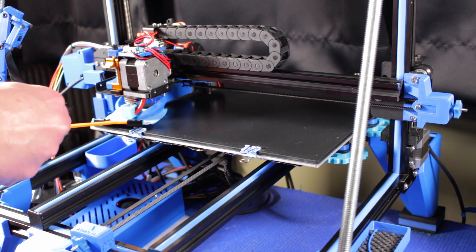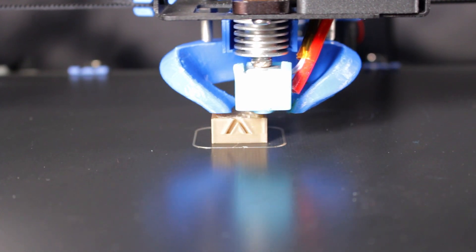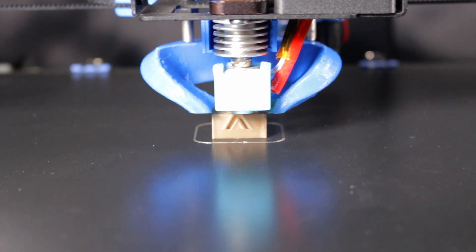Well, that takes care of the repair and the mods. All in all it really only took about an hour from start to finish — 27 hours if you factor in the filming and the editing. Once everything was put back together I did a manual bed leveling since I don't have auto bed leveling, then I ran a few test prints just to make sure the belts and the wheels were all tightened and working properly. It's a good idea to keep an eye on these things because the wheels and the belts are both wear items. I also recommend having a few spares on hand just in case, and maybe even have a 20-20 extrusion ready.